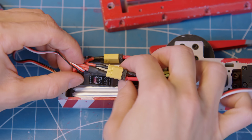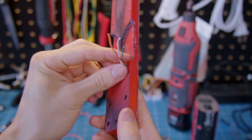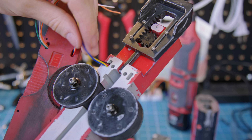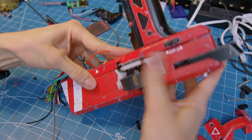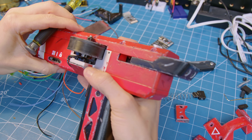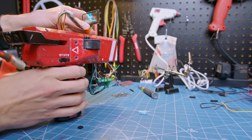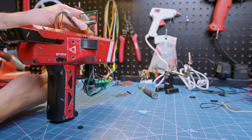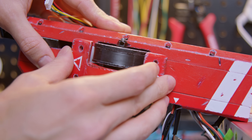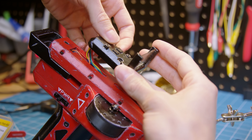The hardest part by far was squeezing all the electronics into the cutout underneath the barrel. To keep all the wires hidden, I made a bunch of tunnels inside the parts that the wires could run through. Even still, it was an extremely tight fit, and it took several tries for everything to stay in place when I went to close up the frame. After connecting all the wires to my custom circuit board, it was time for the first test. Fortunately, it was successful, which meant I could now attach the last few pieces to the frame, including the transparent OLED I would be using as the sight. And with that, the PEZ Pistol was finally complete.